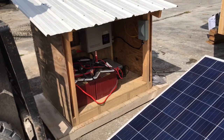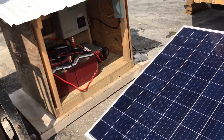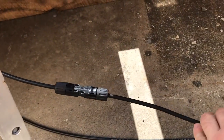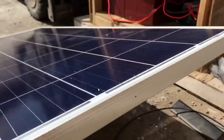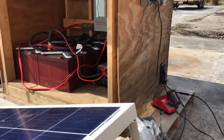This is a one to two day project to put together if you're a do-it-yourselfer. As a last note on solar panels: you hook one panel to the next through MC4 cables — you can't hook them up wrong. The extension leads go back to the inverter. Be careful about voltage: open-circuit voltage adds up with every panel you add in a string. You can do strings of three or four depending on the all-in-one inverter, but you don't want to over-voltage it because it can damage the unit. I hope you've enjoyed this video and found it educational. Until next time, Seven Trumpets forever — have a most blessed day.